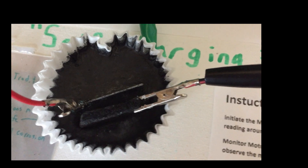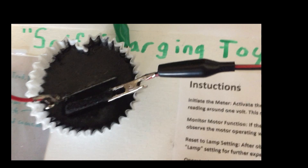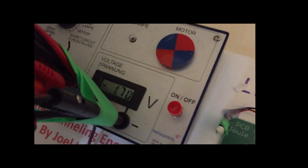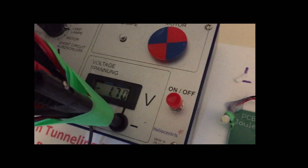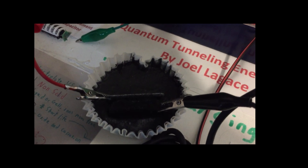This one here is the best — the copper oxide and PEG mix only — and this is what I get overnight: about 1.6V. The structure is different; it's not the same salty crystal that breaks if you press too hard. This one here is very good. I was able to get the cathode and anode very close together, same hard electrolyte, not even conditioned yet. I just added the copper oxide powder to the mix and I think it's making a good difference. It used a carbon electrode — it looks like one — but that's how close I was able to get it.